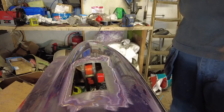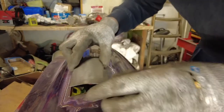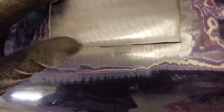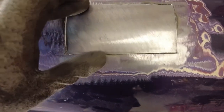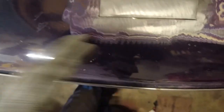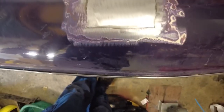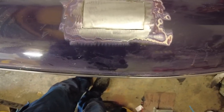Let's just see if more of a bend will do it. I need to just take a little bit off that. Perfect it is not, but at this moment in time it doesn't need to be perfect. What it needs to do is fill a hole, and then what we can do is use the hammer and dolly to kind of straighten everything out after the fact. What we're looking for now is a few points where I can kind of tack it — somewhere where it's level and flat between the two pieces. You don't want it raised up on one side, because when you're grinding off the welds you're going to be grinding down some of the metal as well. Let's get the welder set up.